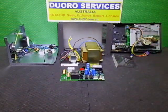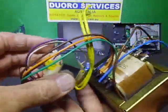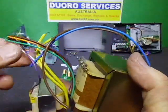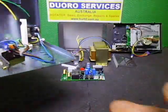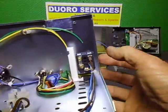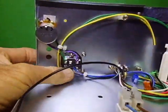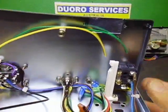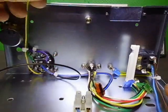I've also wired the power side — this red socket is the power feed into the PC board, wired onto the transformer. The AC side will go to the terminal block when I get to that stage. I've installed the right-hand PC board support, terminated the IEC socket, terminated the pot — which is now installed — and the output socket is wired. The remote socket is also installed.